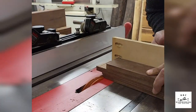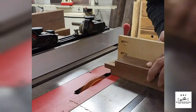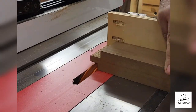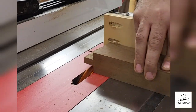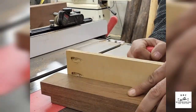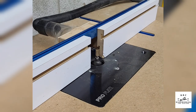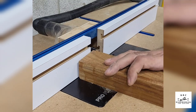This is the third method I used to cut the shoulders on the tenons. Doing it with the table saw works and gets you a very even tenon, but it just takes away some of the fun. The only time it was much more effective was for the 12-degree angle cut — trying to set that 12-degree angle by hand is a little bit tougher, so knowing you have the backstop of the miter allows you to make sure you have a more precise fit. Once the final sizing was done on the legs, I took everything over to the router table to round off the bottoms and prevent any splintering.